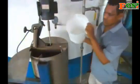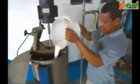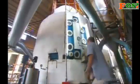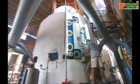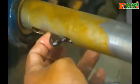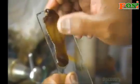Workers now pour microscopic sucrose crystals, suspended in alcohol, into the syrup. This milky solution binds to the sugar present in the syrup and helps draw it out. Next, it all boils in large vacuum pans, forming sugar crystals. As the water in the syrup boils away, workers regularly check to see how the sugar is crystallizing. The goal is to produce a thick crystallized paste known as massecuite.